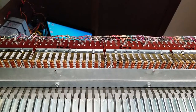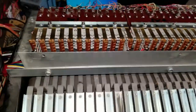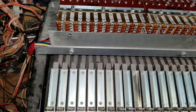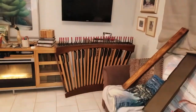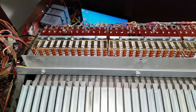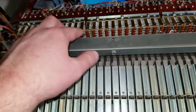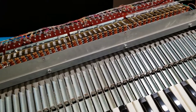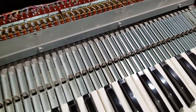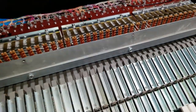The problem was the pedal grouping wasn't as nice. The boards were the same size, but there would only be a wire every few positions — one board would have six notes on the pedal board. The pedal notes are spaced further apart, so the first octave had two groups of six joined by a wire to make a group of 12. The second and third octaves were grouped in fives, which was more challenging.